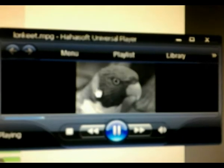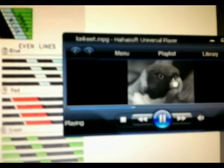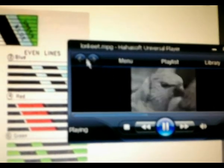What I have set up is pretty much a frame sequential system instead of a field sequential system, so it's pretty much red, green, blue, red, green, blue, red, green, blue, one after the other. So I'm pretty much getting a full color frame rate of 20 frames a second of flickery pictures.